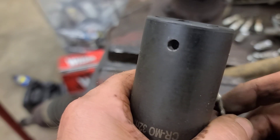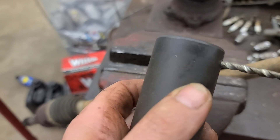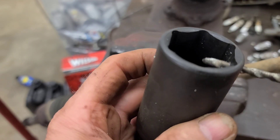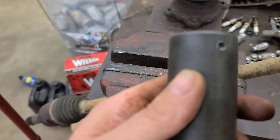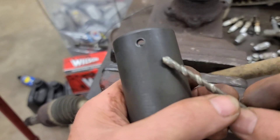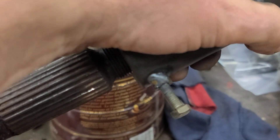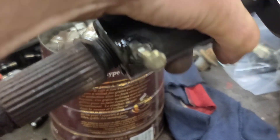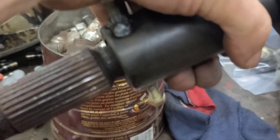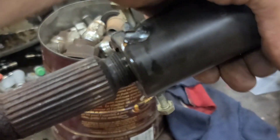I managed to drill through this socket with a concrete drill bit. I had to sharpen it five or six times each side, and it actually drilled better with no oil — when I put oil on it, it stopped cutting. I managed to weld two 6-millimeter nuts on there. So now you can split the thread chaser, put it on the threads, put the socket over it, and then work the socket back off rather than trying to start it in the damaged area. I sprayed penetrating fluid in there.